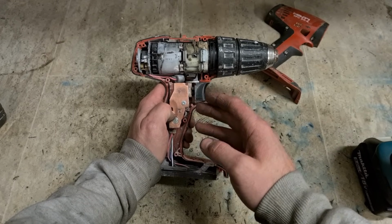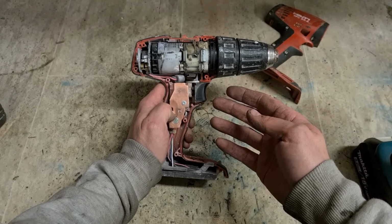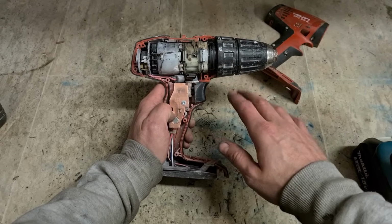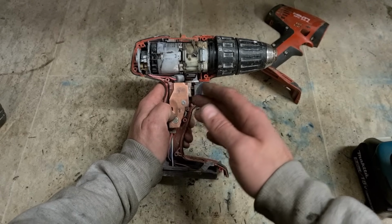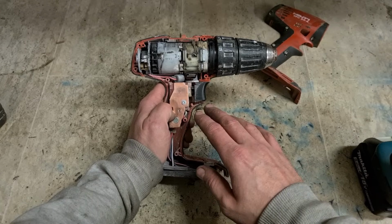So Hilti hammers have a built-in timer. Whatever amount of 100 hours is on it. Once that time is up, the red light comes on. Then you have like 10 or 20 hours of use. Then the machine shuts down completely. Can't run again until you send it to Hilti to be reset, then it'll run again. It doesn't even need to be serviced or anything, it's just a stop device. Stops the tool totally.